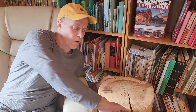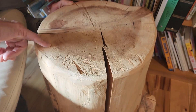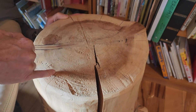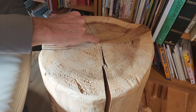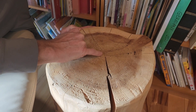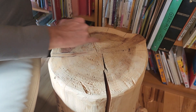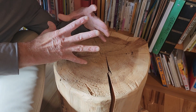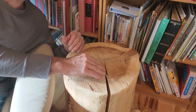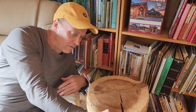If you understand that along the growth rings, wood shrinks about double what it does perpendicular to the growth rings. And in the center, there isn't much growth ring shrinkage to happen, so the check is really tiny. As you move out, this band is shrinking and somewhere that needs to get shorter — so pop, it pops open and you have your check.